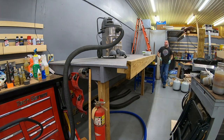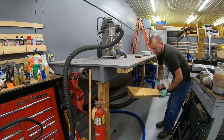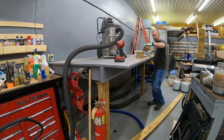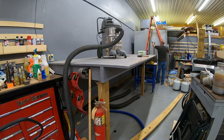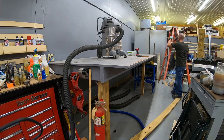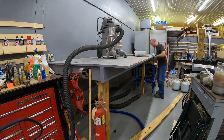The bonus footage will mostly consist of me disassembling the old mezzanine, but it also gives me the opportunity to showcase the differences between the two builds. First, you'll notice the old mezzanine had a kick board on the front edge — that served two purposes: it braced the plywood as it stuck out a foot from the front edge of the frame, and if I backed into it, it acted as a reminder that I was getting close to the edge. I'm unsure if I'll be adding that to the new mezzanine, but since I left a lip on the front edge of the plywood, it would be easy to implement.